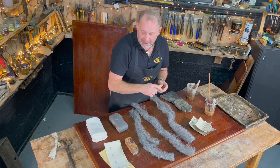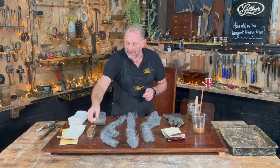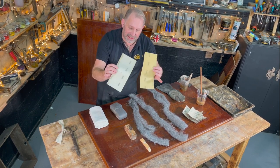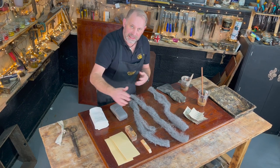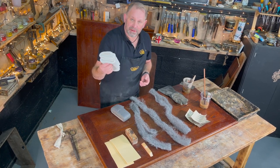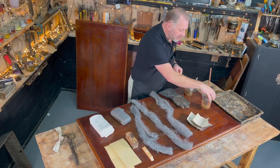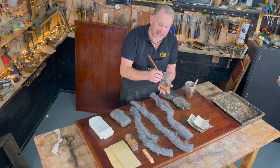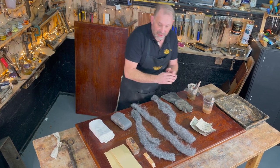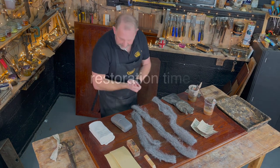This is a little quirking stick, which I'm going to use to get the excess material from around the edges of the table, which is less damaging than a metal scraper. Some 180 grit and 320 grit sandpaper for going through the grades as we go along. Some soft wire wool for applying the wax, and some pure cotton buffing cloth. Right, I think I've got everything. Oh, I didn't mention this bit. We're going to seal it up with some hard wax oil, just a very light coat. You could use another product, but I quite like using hard wax oils, they're really quick. Right, let's get on.